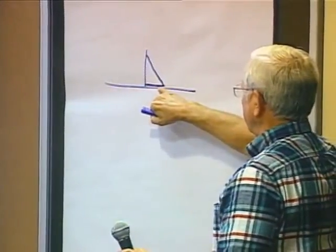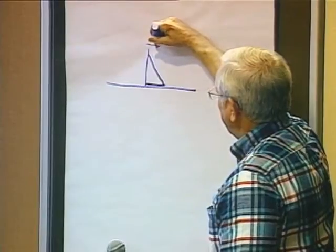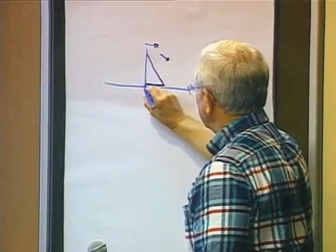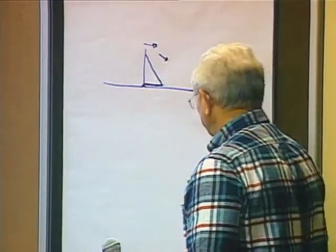Keep it about 1/8 of an inch, roughly, off the base of the belt. So you'll get some deflection this way. And depending upon the width, you may have multiple gussets placed on that cleat, depending upon the load that you're trying to carry.